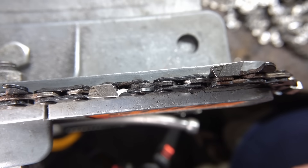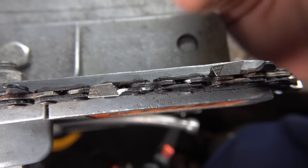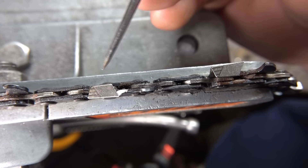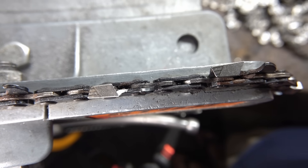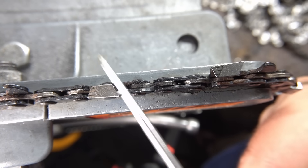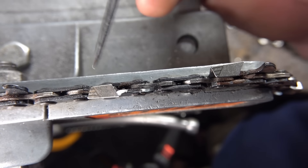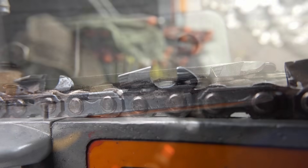We're going to start off by talking about witness marks. The chain I'm using as an example here is Oregon EXL, because I believe the EXL and TXL actually have the best ones. Most manufacturers will just give you a straight line across the back, which is very helpful. Oregon's done it a little bit better — it stands out. This is the most common sort of witness mark, and it's there to assist you to maintain the correct filing angle. It also exists to tell you the limit of the chain — once you've worn back to that point, you're done.